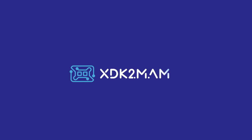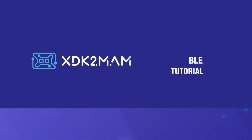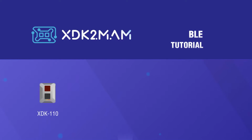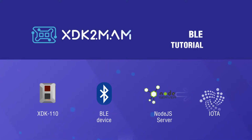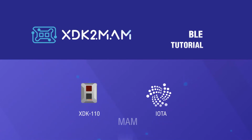Welcome to this XDK2MAM video tutorial for the Bluetooth Low Energy, or BLE, package. Today, I'll be guiding you step by step through the process of connecting Bosch's XDK110 to a BLE listening device and setting up a Node.js server that will retrieve that data and publish it to the Tangle using Masked Authenticated Messaging, or MAM. In this case, the device that will be listening via Bluetooth Low Energy will be a Raspberry Pi 3 with Raspbian OS. But you can use any other device with Bluetooth capabilities that accepts Node.js code.